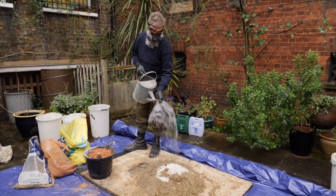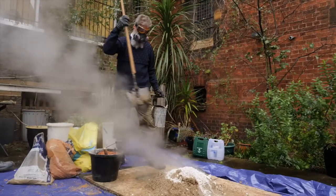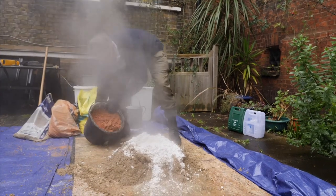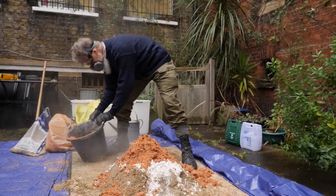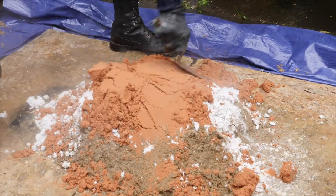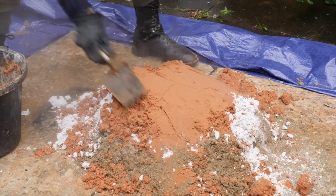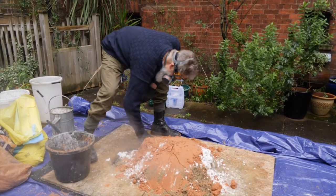This is why you have to have your goggles, eye protectors, mask for vapors, and gloves. You also need to do it outside. We're going to close it over and this is where we've got our red sand to give the mix a bit more of a distinctive colour. The lime will take up the water and it's already reaching quite a high temperature. When you come to work with this later you'll need to use a metal bucket because it will melt a plastic bucket.